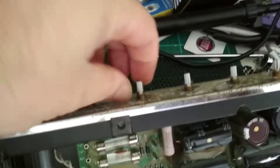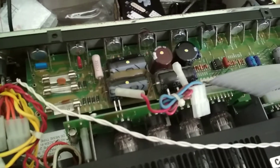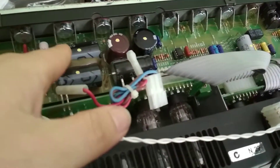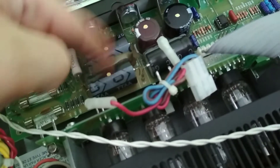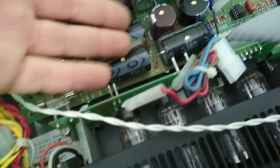I've undone all of the nuts holding the pots in place, every single one of them, just to get this PCB out. Except the PCB is still stuck in there — because there are screws underneath. I'm going to replace these five filter caps, 47µF. Now these are 450V, and I'm going to change them to 500V because PV has done a naughty thing — the voltage coming into these is higher than 450V. These caps didn't have a chance. Thanks PV.